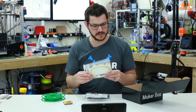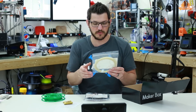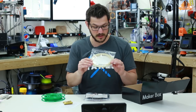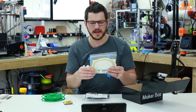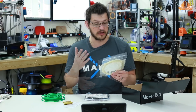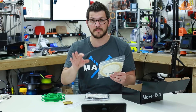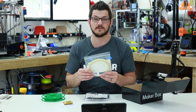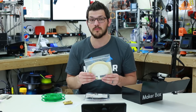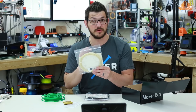We have a new company — this is ABS-PA from Dr. 3D Filament. I've never heard of these guys before or had a filament from them. It's a natural, almost dirty cream color. Hot end temperature is 255 to 265°C. Stop — you need an all-metal hot end in order to print this. If you print this with a PTFE-lined throat, it will most likely melt. So please keep that in mind — you're going to need an all-metal hot end to print this filament.